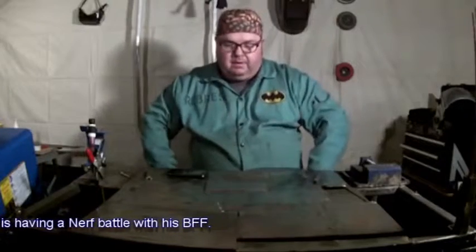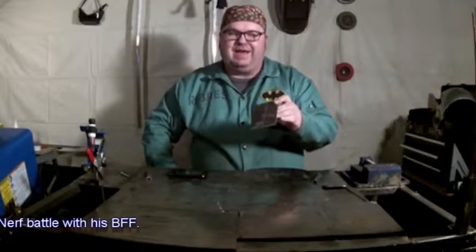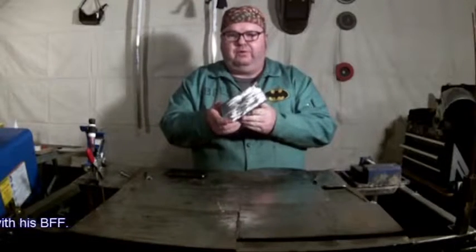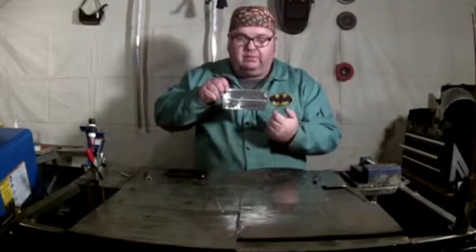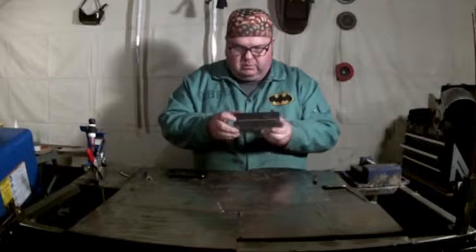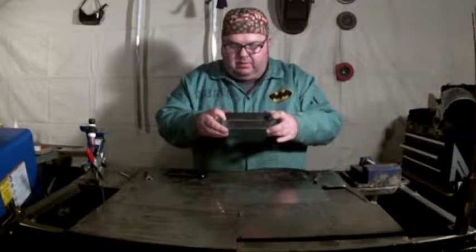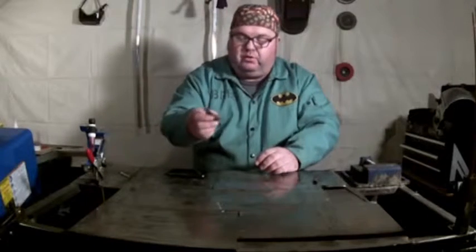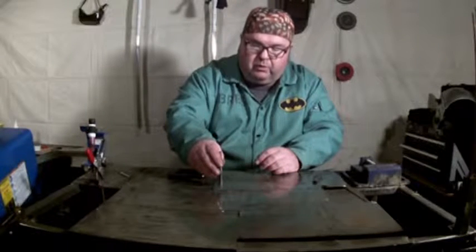So what I did is this is just a piece of 3" by 1/8" bar stock. I cleaned up this side of it with a grinder real nice because we're going to TIG it. In fact, we're going to do something a little different. And I drew this center line, okay, measured the camera 4.75 inches, marked where I need the camera to be, and then the back end of our angle. Also cleaned up the angle because, as you know, TIG likes clean. And then all we have to do is weld them on just like that.